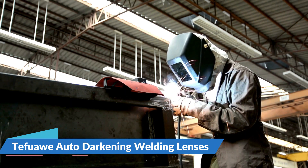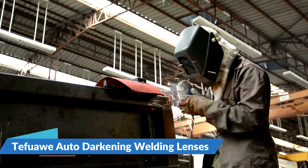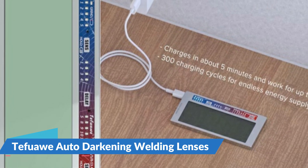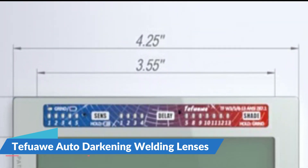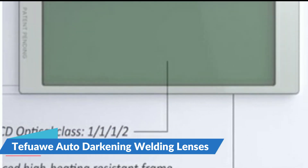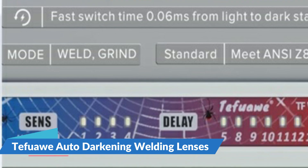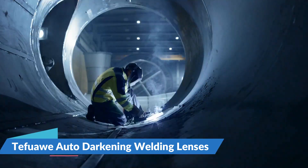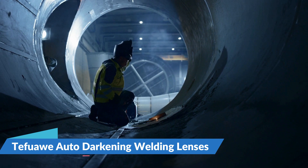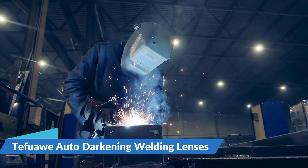The automatic dimming welding lens provides unparalleled optical clarity for your workpiece. You don't have to flip the helmet as often before, during, and after welding, which greatly improves productivity and reduces rework. Two built-in wide-range photoelectric sensors with higher sensitivity allow the lens to detect arc strikes and trigger the LCD into shadow in less than 0.5 milliseconds. Every time an arc occurs, the solar panel charges the lens. Gold high definition lenses reflect and absorb 99.99% of infrared and ultraviolet rays, allowing for clear visibility of arcs and molten pools, while reflecting radiant heat to keep operation cooler and reduce eye fatigue.